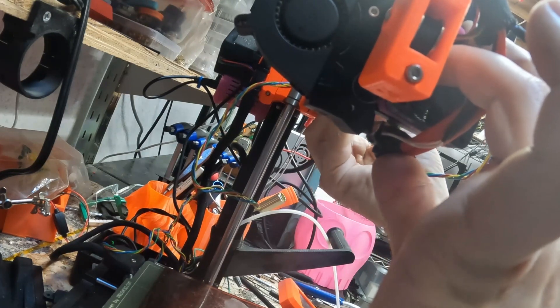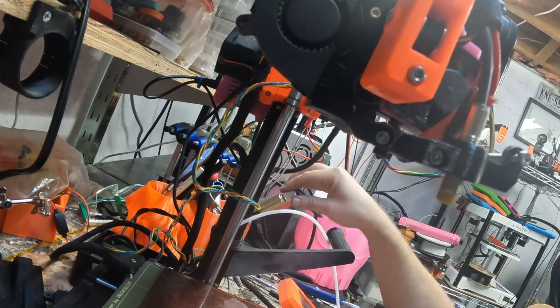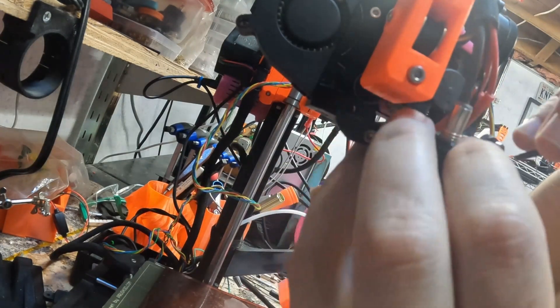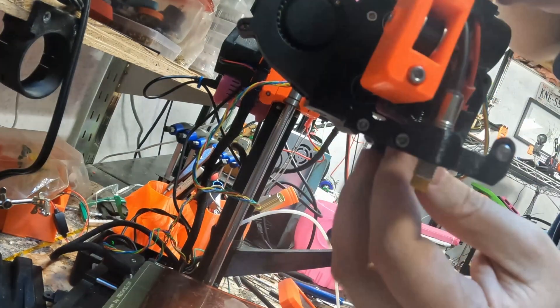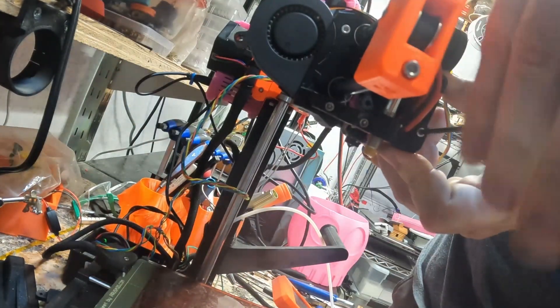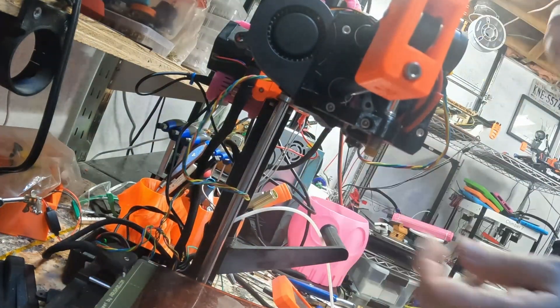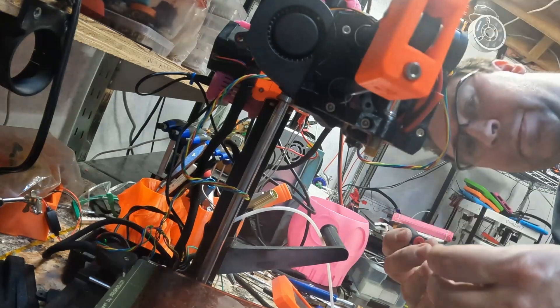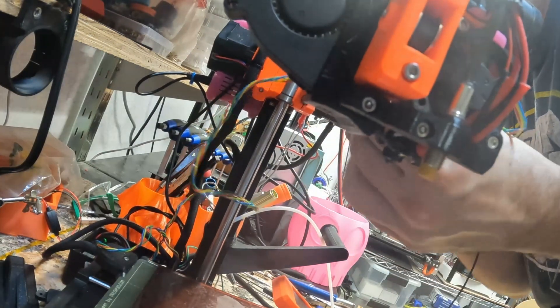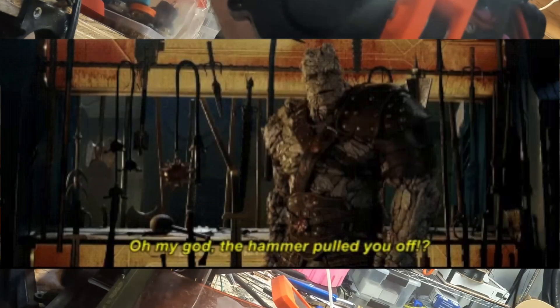One of the nicer things in the newer Prusa Mini firmware is that it actually supports different steps per millimeter for the hot end, so no longer do we have to send that in G-code - we can set it in the firmware directly. Hot end wires are in place, fan is in place. My sensor looks a bit low but I'm not going to adjust that right yet. There's one final screw on the opposite side to help hold the Orbiter in place - I figured you don't really need it, but after it pulls itself off the first time, let's say it's pretty required.